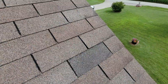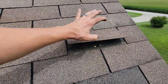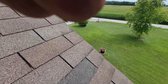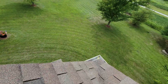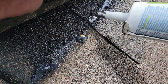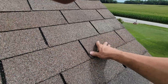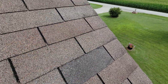A lot of people will leave that right there as done, and that is not done — this will never seal. These will stick this half here into the new seal strip just by pressing. This will never stick, and the next thing you know this will blow off and crease — usually that's the first one to go because it's way more dry. The last and most important part when you do a repair like this — doesn't matter if it's three-tab or dimensional, as long as it's asphalt — use the sealer of your choice. Does not take much. Under this bottom, just a couple dabs near the nails and on the ends, and it just takes very general pressure to push down. Same on these outer edges where there is no seal strip — it won't ever seal on its own. Give it a nice little push to lay flat. Give it an hour or two, this stuff will start setting up and be dry, and it will not blow in the wind — you'll have a successful repair.